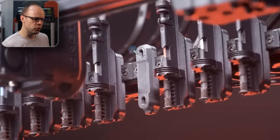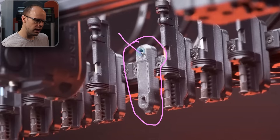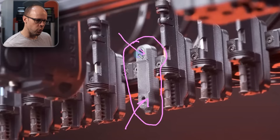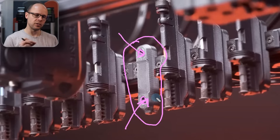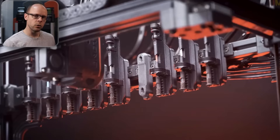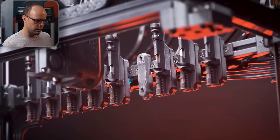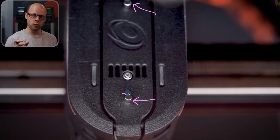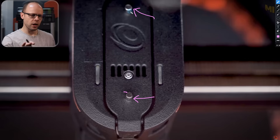It has grabbed one of the tools and we can see right behind it that this is all FDM 3D printed, and there are these elongated slots in here as well. We saw that when it grabbed the tool it pulled it up into position, so that's why I believe those slots are elongated. Now what's inside of these might be either a magnet or it could be a steel piece like a screw for example. On the opposing side we should see either a magnet or something steel as well. These look like they are magnets just because of the slight radius and the kind of chrome finish, but that's how it looks to me — that's how it's mounted to the frame of the printer.